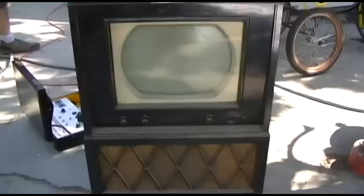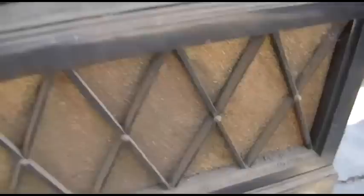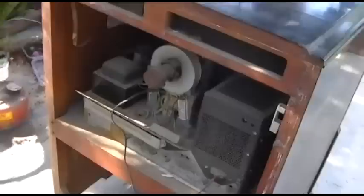Okay, next on the list is, it's a model number on this, RCA 9C272. This is a KCS 29C. Two missing vacuum bulbs. This is a complicated chassis, isn't it? These run a positive and negative B plus. Tons and tons of electrolytics.